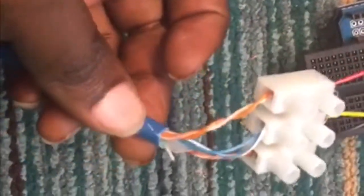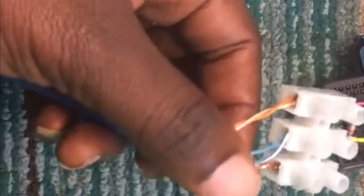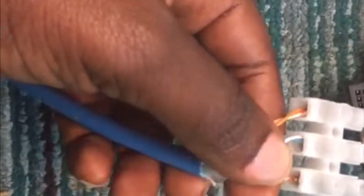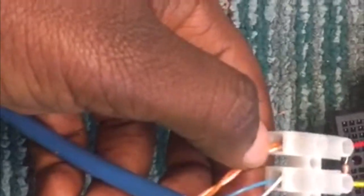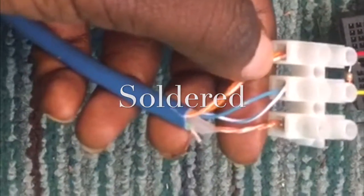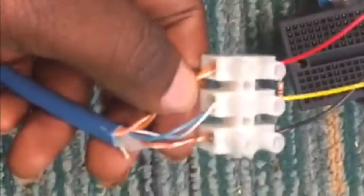Since I'm using a cat5 wire to extend, I connect it to my terminal block, and then at the other end I connect the cat5 wire to the terminal block. I had to cut the edge of the wire off and strip the wires to expose the metal part. I then soldered the connections to make sure there would be maximum connection and no connection breaks. Then I put them into each part of the terminal block and screwed them in with the screws.